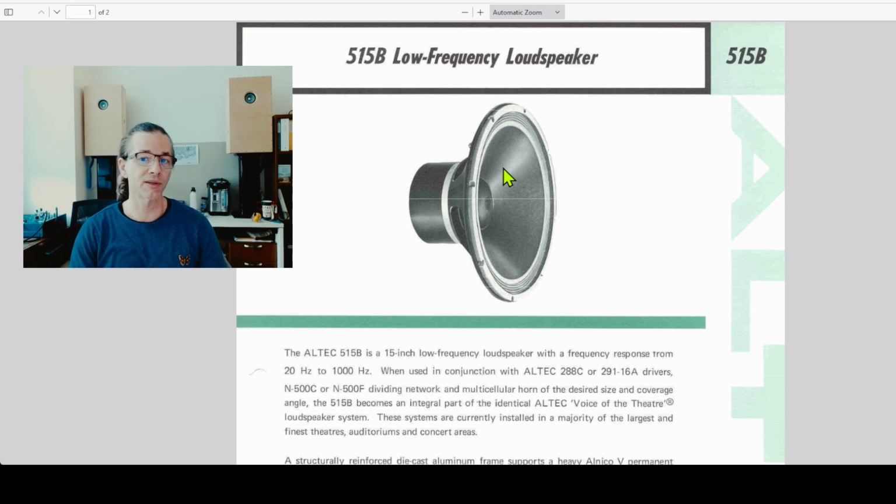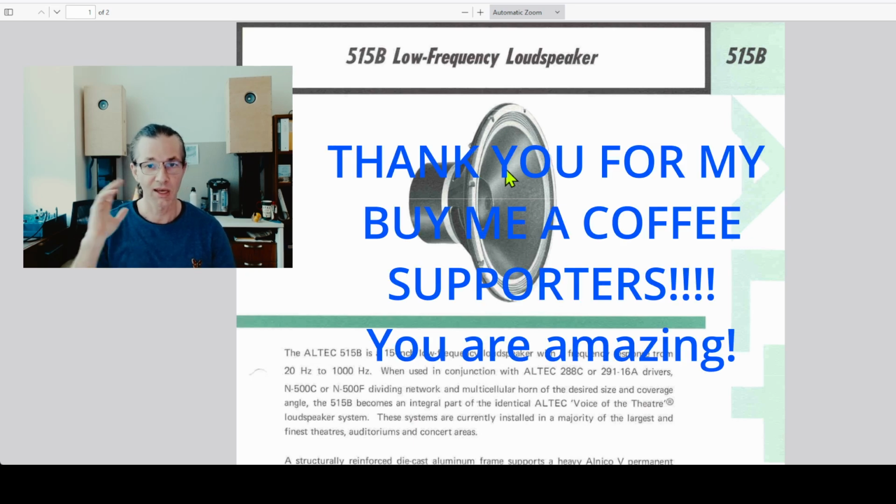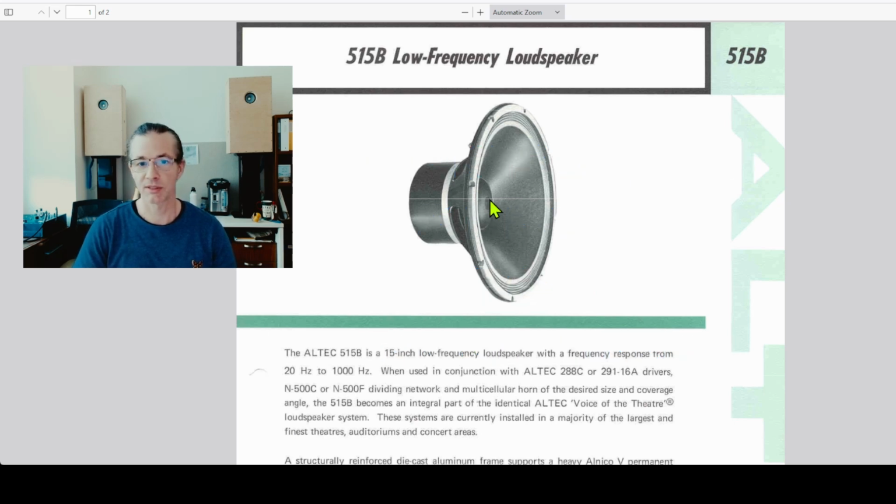It will have a very vintage retro sound to it, and initially it will be fun to listen to without a crossover, but after about half an hour or an hour, it was really bothersome to listen to, and I just stopped because it was even painful, those high frequencies beaming out from the middle. It's pretty painful and extremely loud. So nope, full range Altec woofers don't work because they are mid-range drivers.